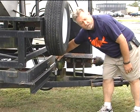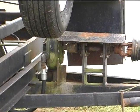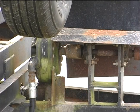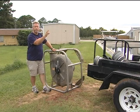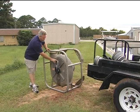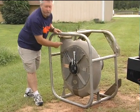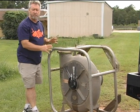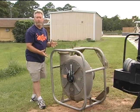This particular fish pump is run by a hydraulic pump, so we have hydraulic fluid which comes to this pump, then circulates through these tubes and is transferred out to the actual fish pump. Our hydraulic pump is moving the hydraulic fluid through a series of hoses into a second motor right here, which actually drives this very large fish pump. The fish pump is moving a lot of water with a very large impeller, so it doesn't impact the animal.